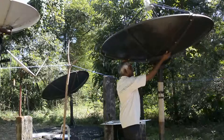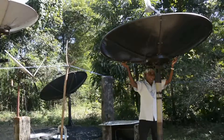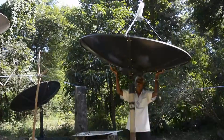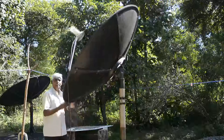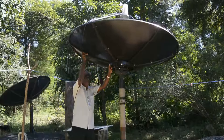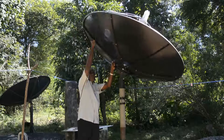This is a 300-degree movement around the pole to get the peak adjustment of the peak signal level. This is the elevation adjustment — this dish can move around about 300 degrees from east to west.